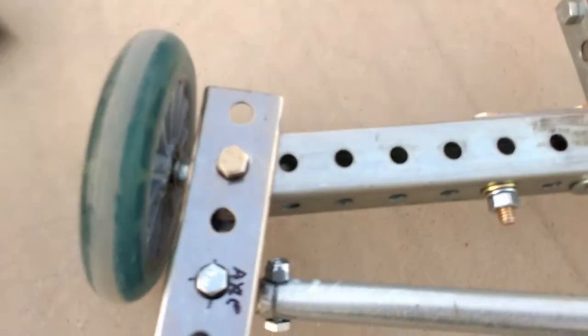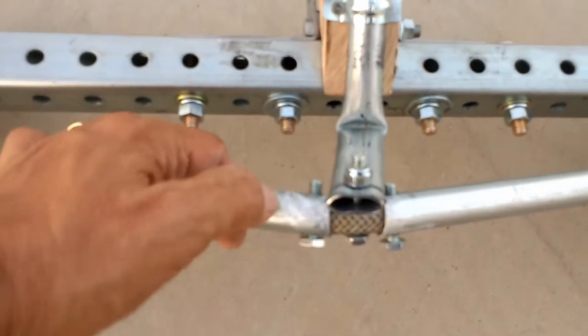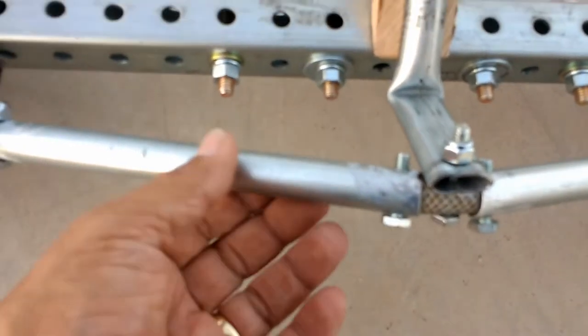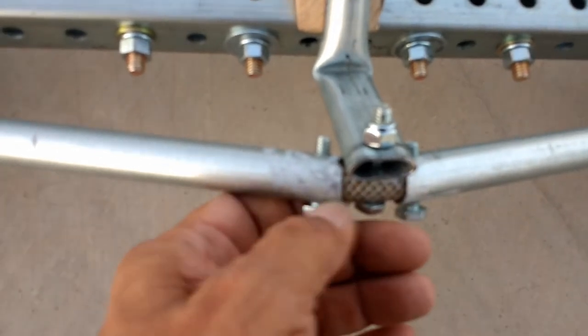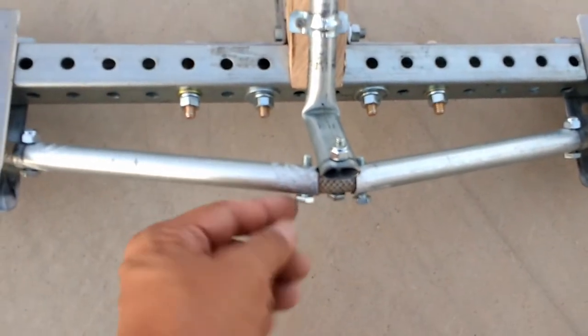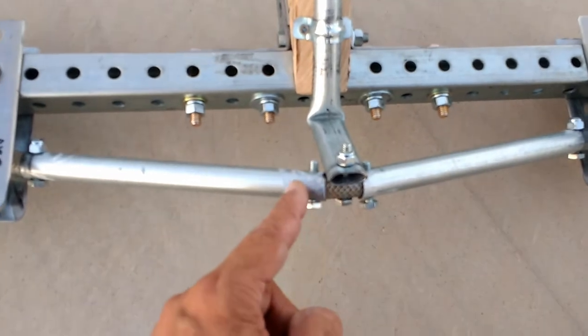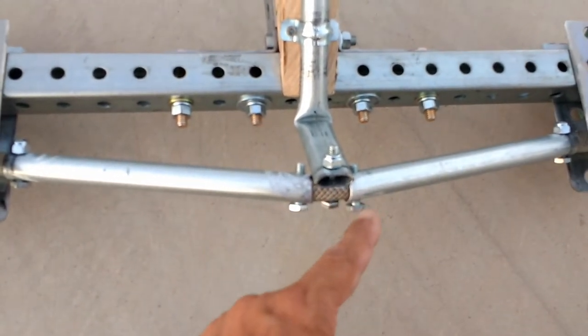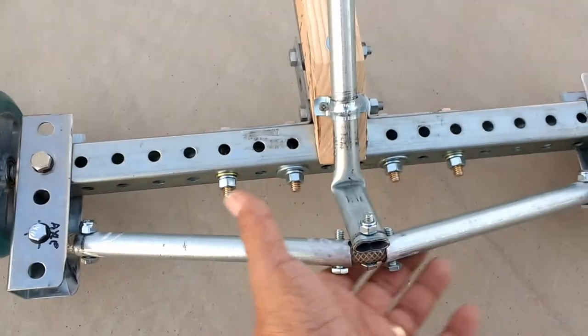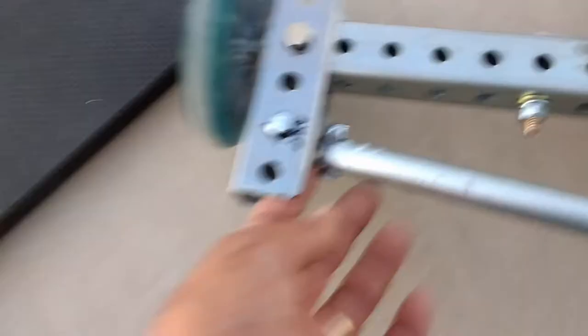The steering here, before I go back to explaining the underside of the hoverboard mechanics. This is a 3/4-inch electrical conduit, fiberglass reinforced PVC tubing. So I took the tubing. It just so happens that it fits right inside there. I drilled holes through there, and it's tied with these bolts here. They don't have nuts because, like I said, this is a tight setup right here, and it's been holding on very well like that, but eventually I'm going to change this and put in proper steering mechanics. This was just to quickly test the concept.